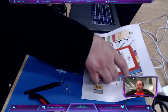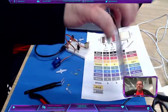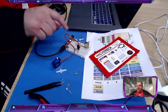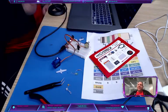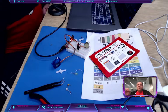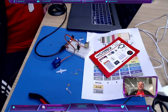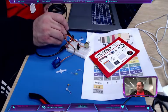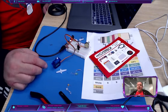But that really kind of concludes everything. So you guys built your circuits. You went through all these different parts. If something didn't work, just check sometimes. I've noticed the components don't sit very well in the breadboard. They might be a little loose. Maybe move them over or something to get them connected better. Sometimes you could take tweezers and literally use the tweezers to create a connection in between, and that helps as well. But I hope you guys had fun.